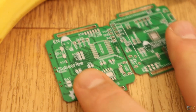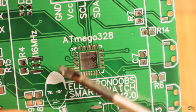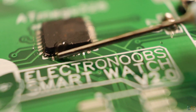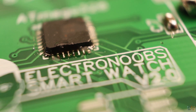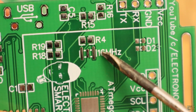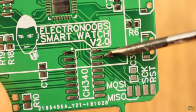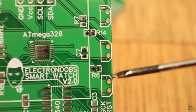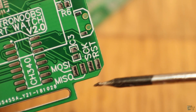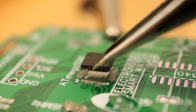Let's inspect the new PCB. In the middle we have the ATmega328 chip in a QFN format. Soldering this kind of chip is not that difficult — with a little bit of practice you can easily do that. Then we have the pads for a small 16MHz crystal. Then here we have the FTDI chip and 3 push buttons on the side.